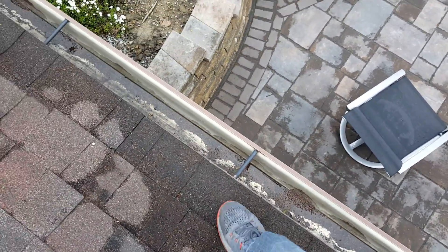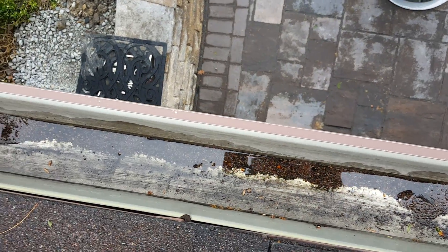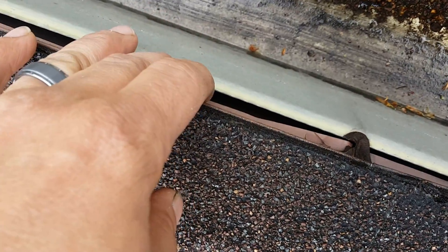As you can see down here, you've got some of your plywood rotted out. That's because this roof's already deteriorated, so there's no seal on it. The gutters might be getting full during the winter, and also some of your drip edges are actually tucked in behind that gutter, so that's going to cause some problems. That needs to be rectified — no problem, we're going to take care of it.